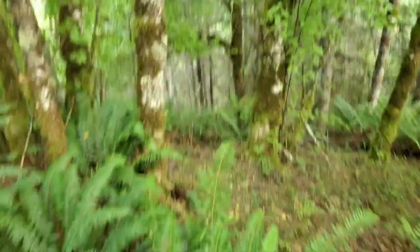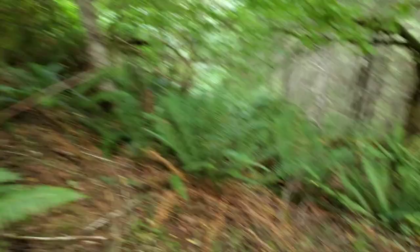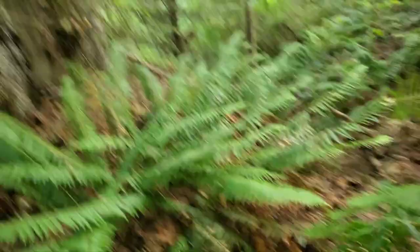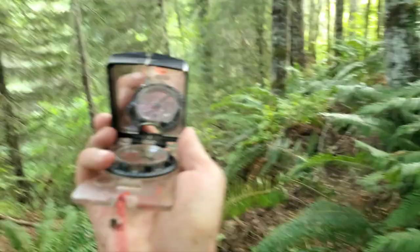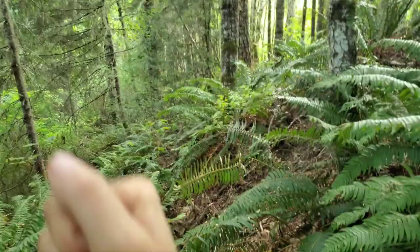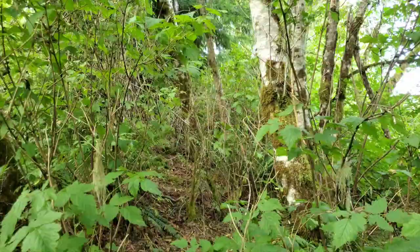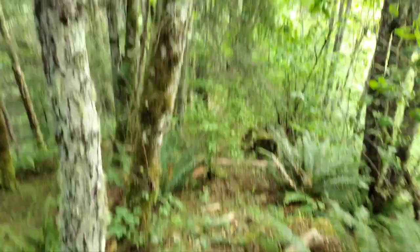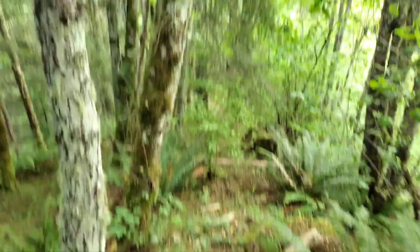I think I'm gonna go look down here and see if I can't find a post and get me back closer to line. Ask and you shall receive — and it is down there a little bit, but not bad. I can pull over. Here's the post. We're going to be going from here. Sometimes the surveying gods are just on your side. There's pink right there — I said I wanted to be right here on this ridge. And I can tie that post as a side shot and do what I want to do. Yes!